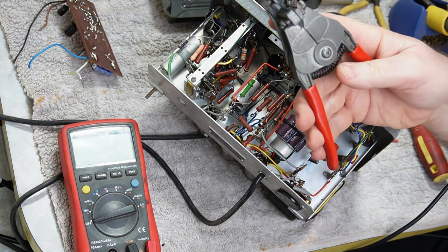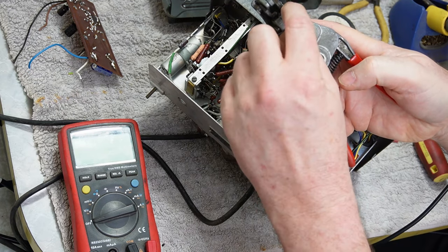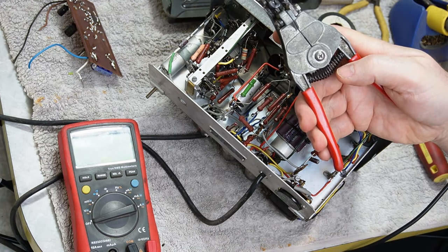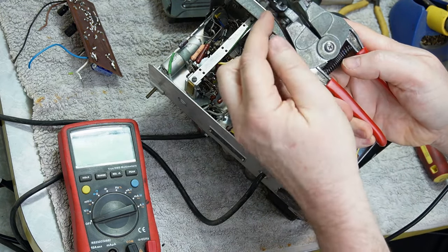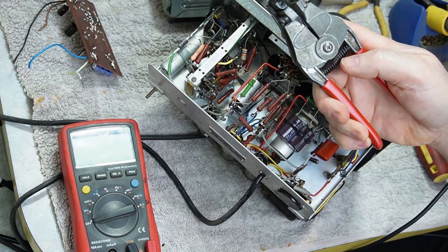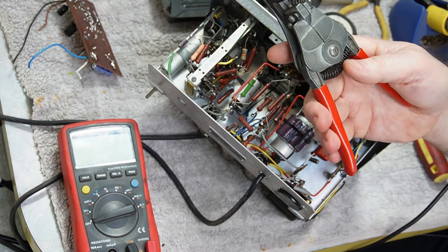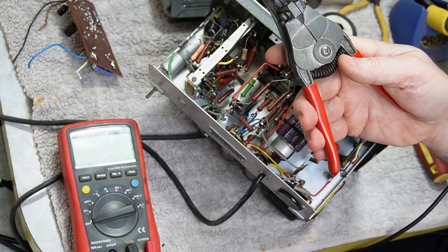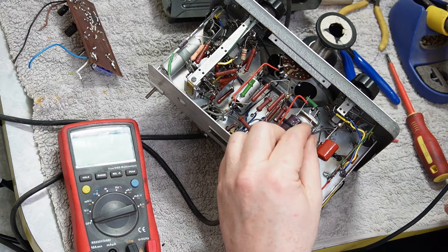But the other thing that can go wrong with these is if you're working at an awkward angle, and I was, and the insulation is not trapped in here, it just bites there and not there, then you'll end up pulling. Now that's fine, because if the wire's long enough, this will just move and the wire will just move. But if it's not long enough and the body of, say, an 80 or 90 year old IF transformer gets trapped behind the lip of this, you'll tear the wire right out of the former. And if you're not looking, if you're on this kind of angle and you can't see, then you'll tear the wire, the staple, everything out of the wood, and then you'll tear the Litz wire, which is, well, let's just say rude words were mentioned many times.